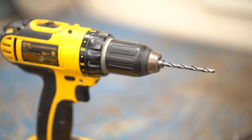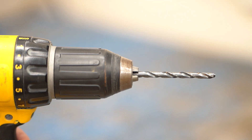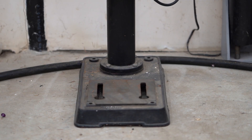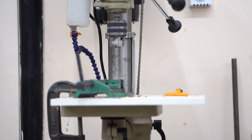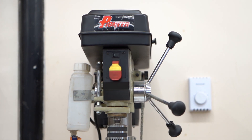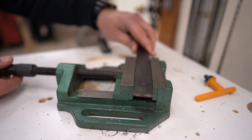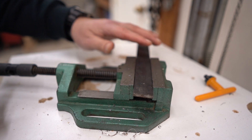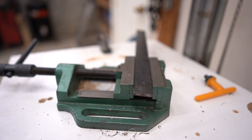Then you pick your drill of choice. You could use a hand drill — absolutely nothing wrong with that. I went years with just a hand drill at my disposal and made a ton of stuff. You could get by with a $100 drill and call it done. But if you want precision, repeatability, stability, and to ensure your holes are perpendicular to your workpiece, a drill press is the answer. Now that we've center punched our part, we can load it into the drill press vise and drill a hole. You can get by with various options when drilling aluminum or steel, but if you're ever drilling plastic, a securely mounted vise is mandatory.